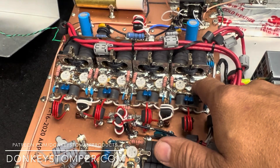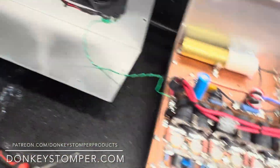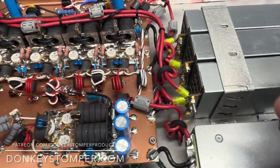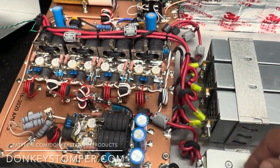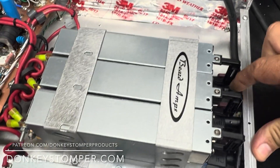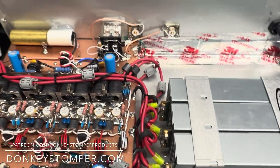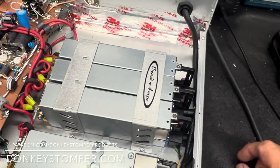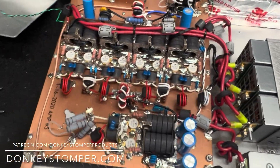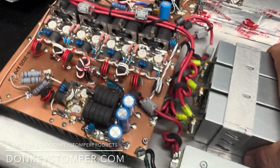So this transistor was causing the oscillations. My bet is it was hanging up when they were trying to run it, drawing current all the time even when unkeyed, and that's what killed the power supplies. Anyway, we've got four new power supplies in. I didn't have a four-bracket, but I went ahead and added an extra one as well. I shortened all these wires as short as possible — you don't want them long. These power cords are just barely big enough to do the job; these supplies draw up to nine amps apiece, and regular power cords are barely adequate, so I drilled the holes and mounted them back, then soldered it all down. Four new supplies — that's what it takes to run this.